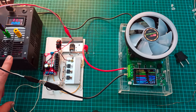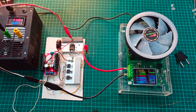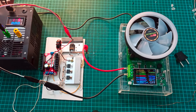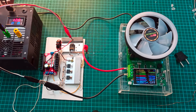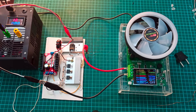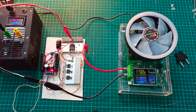I have connected my bench power supply — I made a complete video on building it from a computer power supply, so check out the link in the description. Here is the 185-watt load tester. We are going to put a load on this circuit and see if it can provide 6 amperes or higher. There are some limitations — these wires are not rated for 6 amperes — so I have to keep the test within limits to make sure no component burns.